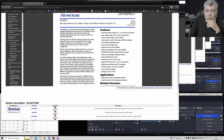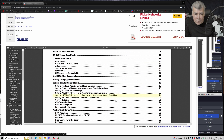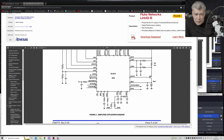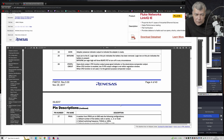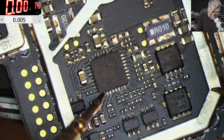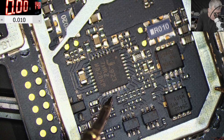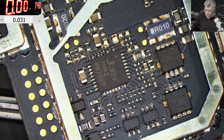So input voltage, system output voltage. This is the schematic — it's exactly like in the MacBook. You remember we had a HP laptop and the VDD pin was not 5 volts. We have DC in and we should have voltage. So DC in and VDD — DC in and VDD are next to each other, pins 17 and 18. So this one is DC in and it's dead. And VDD — VDD we have 0.5 and again it's not good. So why this pin, which is DC in? I will show you what DC in is.